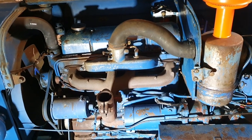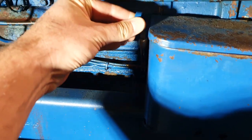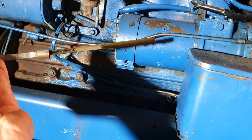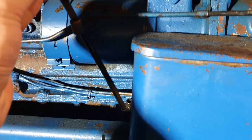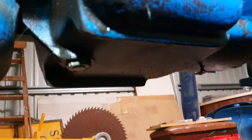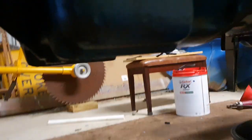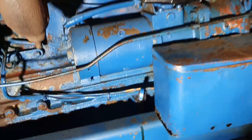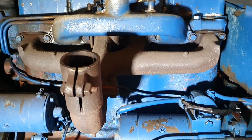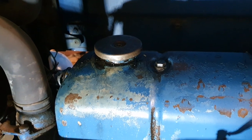We'll start with the engine. Down here, right near my toolbox, there is a dipstick that goes straight into the sump — don't worry, I'll be changing that oil. To drain it, we have to go right underneath to the bottom of the sump. You can see that drain plug just there. Undo that to drain out the engine oil. That little plug nut might take a few knocks so be very gentle — you don't want to strip it. To fill, pour straight in the top right there.